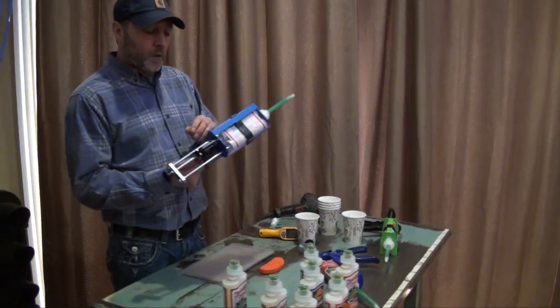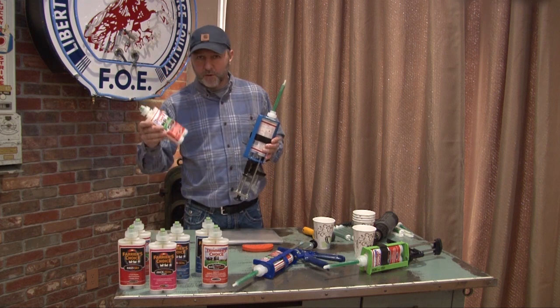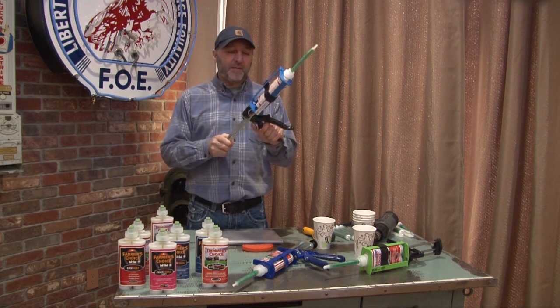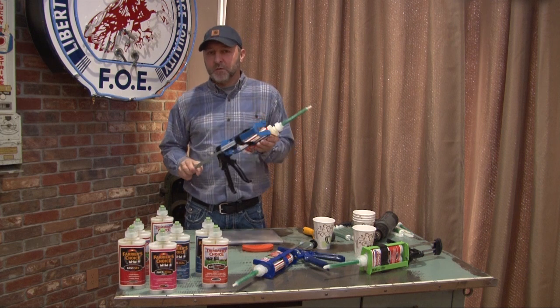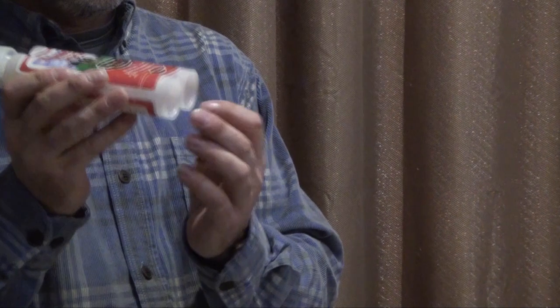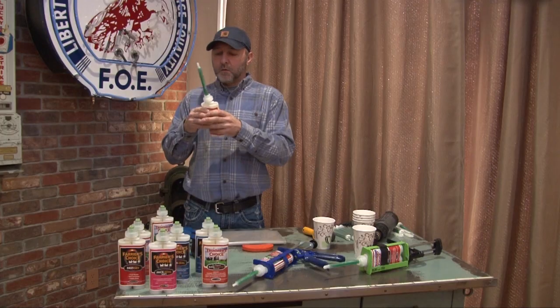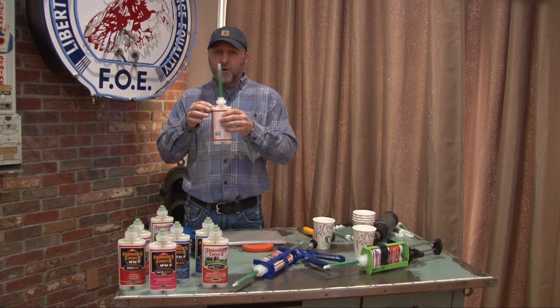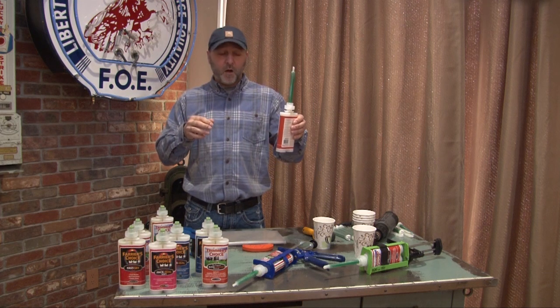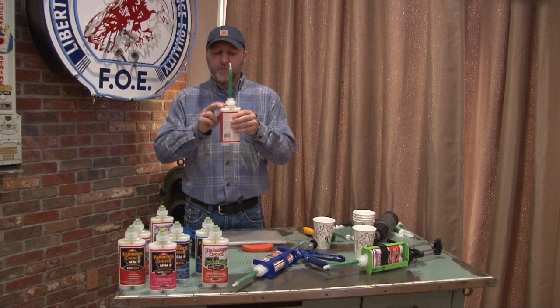So we're working with Trimmer's Choice today, because that's our brand. So the main thing, always, be it winter, summer, fall, doesn't matter when, we always want to self-level the pistons in the cartridge. That's critical. Always want to do that, whether it has a mixer on it and you've already used it to apply a few blocks, or it's a brand new cartridge out of a case. You always want to level the pistons.